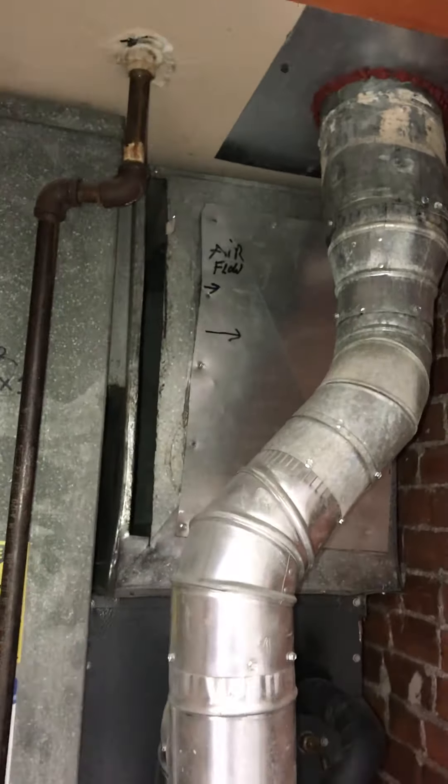There's a five-inch liner coming out of the roof, which is pretty close by, so we need a transition to drop down to the four-inch for the new furnace.